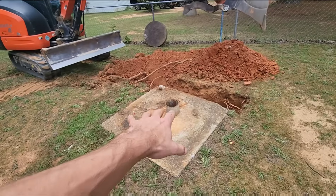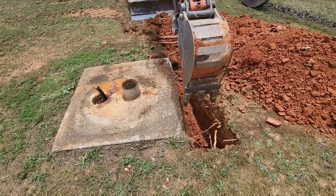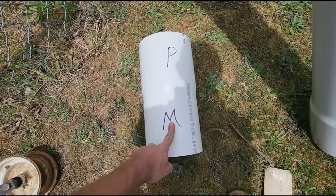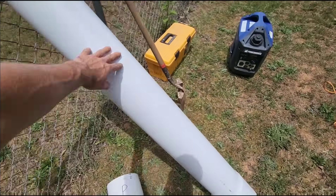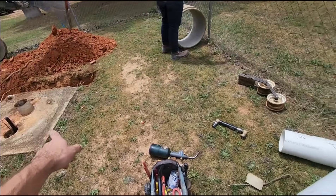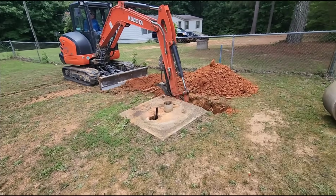The goal here is not to allow too much debris to fall in the hole. I think when we pull that pad off, it's going to be a big hole anyway. So for anybody wondering, this is a plastic-to-metal transition — this is going to adapt to the metal casing that's in the ground, and the plastic side is what we're going to slip this five-foot piece into. This should be long enough to bring it above ground level. Because the pipe was probably welded down below, we also brought a four-inch grinder so we can cut it flush and smooth it.